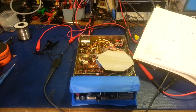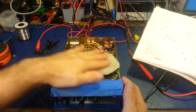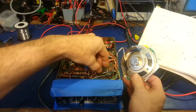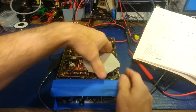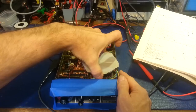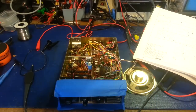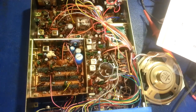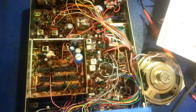Sure enough, the PLL synthesizer is not doing anything. This has a 10.240 crystal. Let me remove the speaker — I keep cardboard over it to avoid sticking a probe through it. These are ones with the little mounting bracket actually soldered to the circuit board with a dot of glue. The synthesizer circuit in this is a very early one — let me hold the radio up. Here is our 10.240 crystal, right in front of my finger.